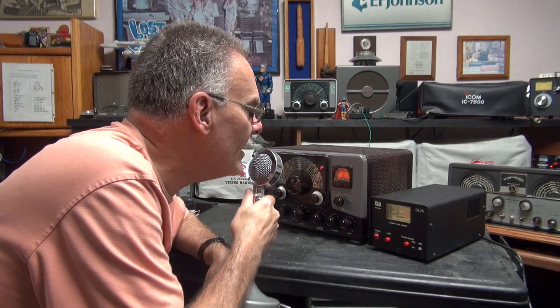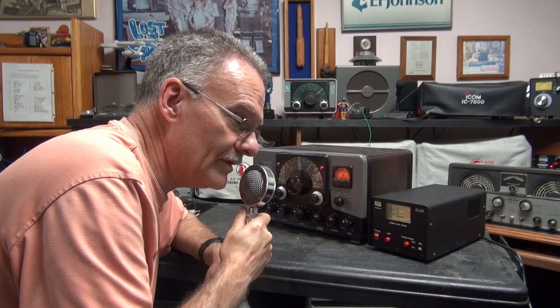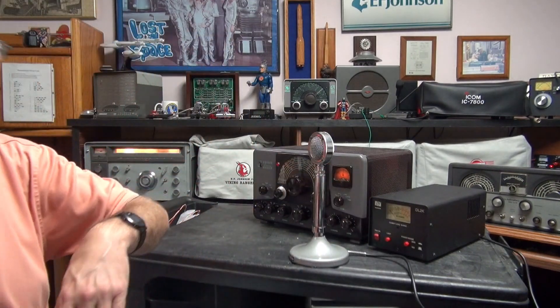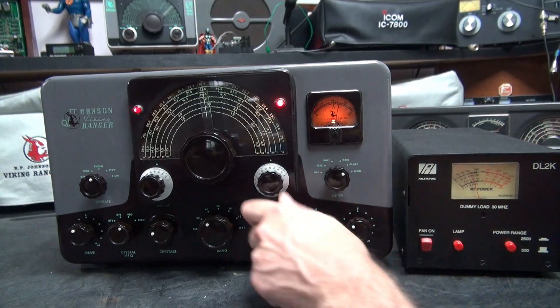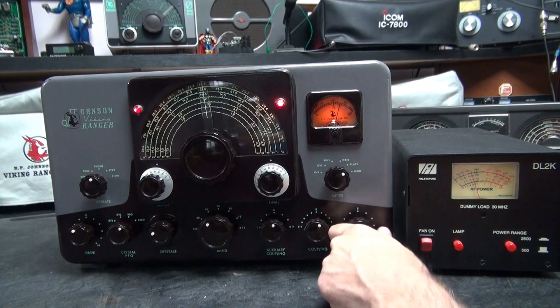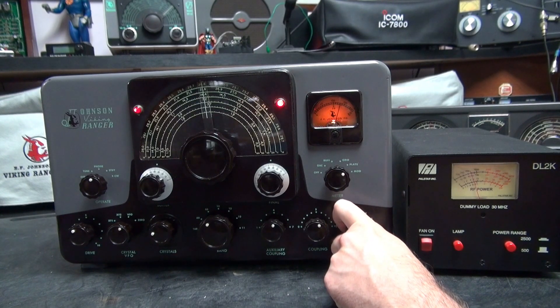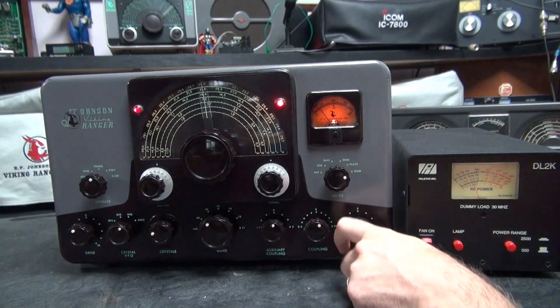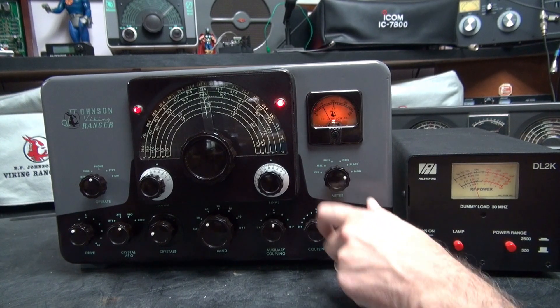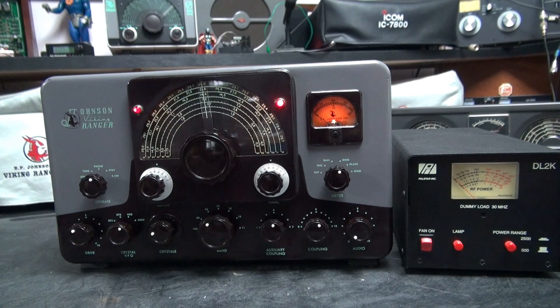She's dead keying at about 50 watts and I'm seeing well over 100 watts of forward modulation. Let me cut to the metering here real quick. So now we'll get a close-up of this beautiful Ranger — you can see the metering. There's our plate right there — dip it. Sitting here at about 45 to 50 watts dead carrier, and she'll modulate well over 100. Plenty of audio gain. There's my static modulator current, and of course our grid. What a super nice Ranger — finding something like this at a swap meet and repairable is a rarity. This guy got himself a great deal.